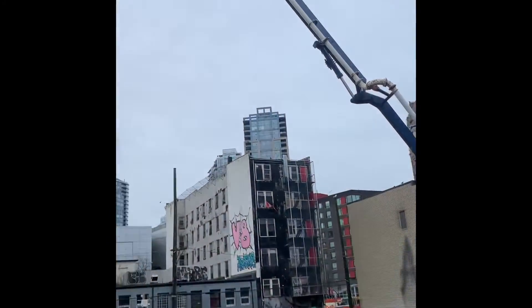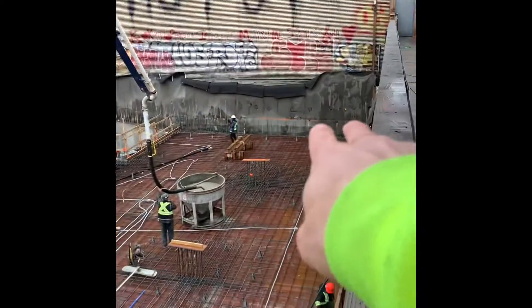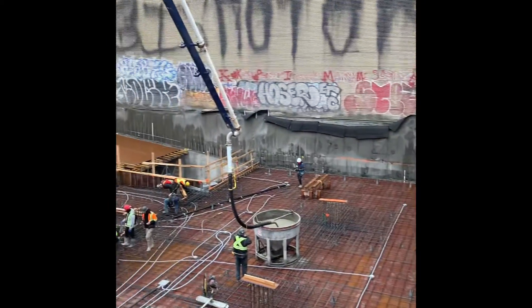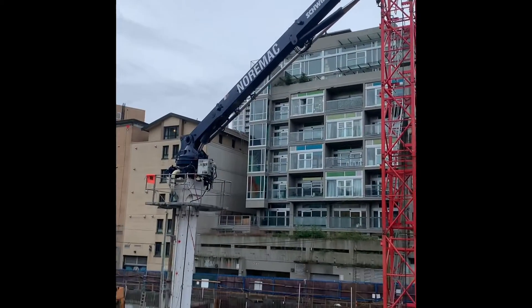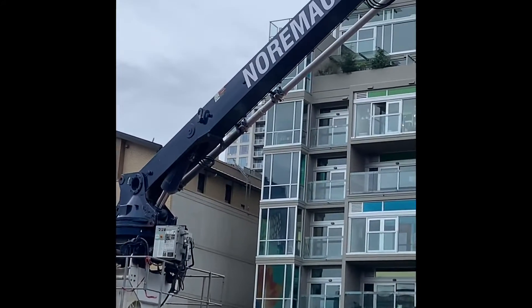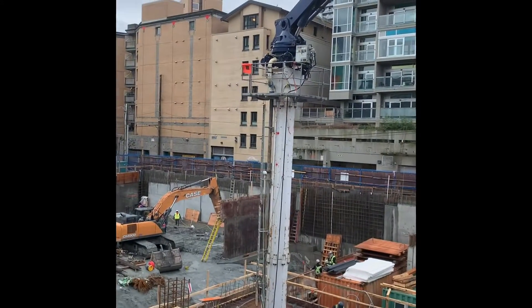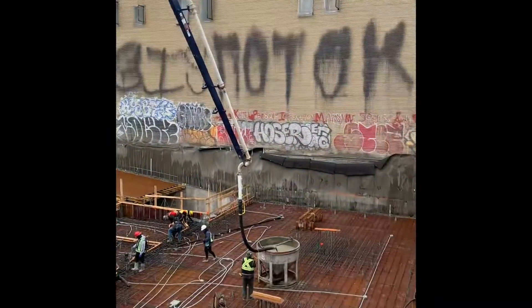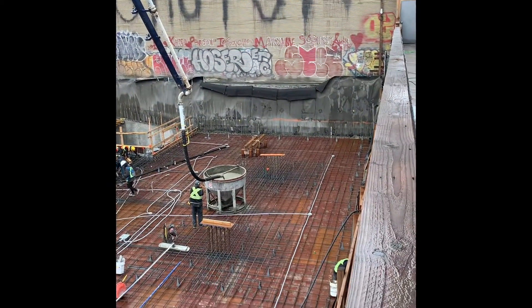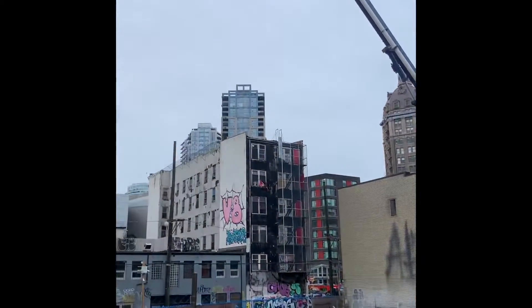This 41-meter swing boom will have just enough reach to get to the far corner. A special thanks to our friends at Normat Concrete Pumping for graciously providing the rental of this piece of equipment. With a typical 36 or 38-meter boom, we'd probably need to run a couple of hose links for this deck, so this is just about the perfect size for this job.